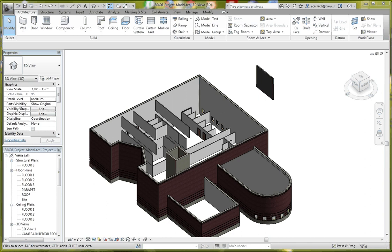What we have in here is a lot of our interior components in our building. It's a practice building, and we have a lot of interior walls. But what's missing are some of our floors. The first floor is going to be a little bit different from the other floors — it's going to be standalone, not structural in any way, just supporting the interior non-load-bearing walls. So we're not going to include that into our structure, but we need to think about the structure of the building to support the second and third floors.